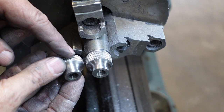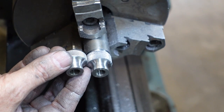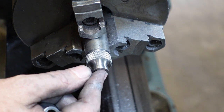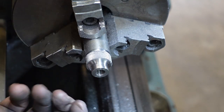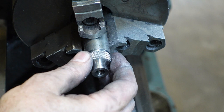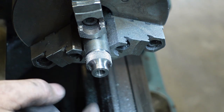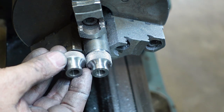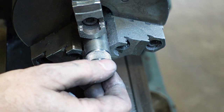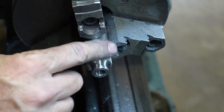I'm making up the replica knob. I can't remember how I made this one - this is actually a copy from my drawing. What I'm doing is I've decided I'm going to put the thread in so I can put a bolt on there, and then use that to dome the back surface there. You could do it the other way around, but then if you did the doming and the knurling and the shaping, you've then got to work out some way of holding that so you can put the thread in there. So I'm doing it this way. Now that I've got the knurl on there, I'll part that off, and get a - it's actually a 3/8 BSF bolt - mount that on there, and then shape the front of the knurl with the file.